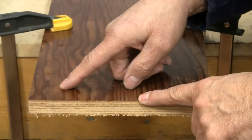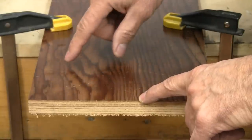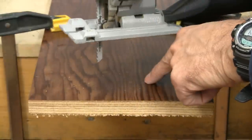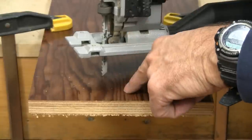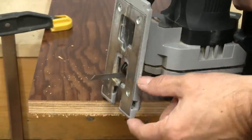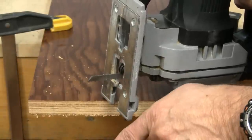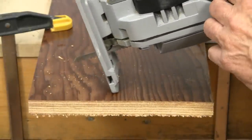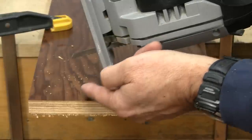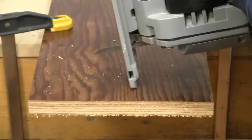The last trick I'm going to show you is how to cut a hole in a flat surface without having to drill holes — maybe you have a vent in your floor that you want to replace. You can drill holes just big enough for the blade to drop in, but I'm going to show you how to do it without even drilling a hole. You turn the jigsaw on its side like this. On this particular jigsaw there's quite a distance from the toe to where the blade rides, so it's a little more difficult, but you drag it along the line you'd be cutting and it will plunge in. Pretty simple.